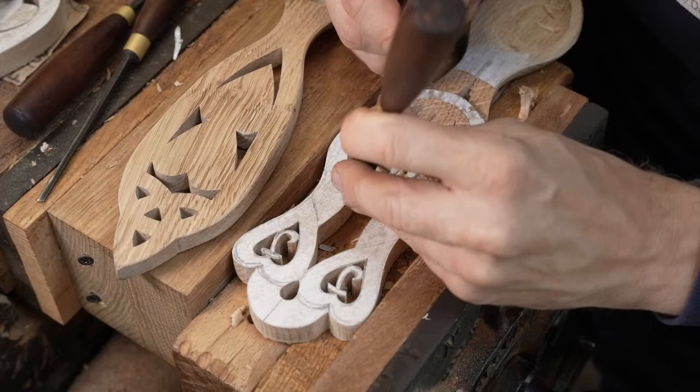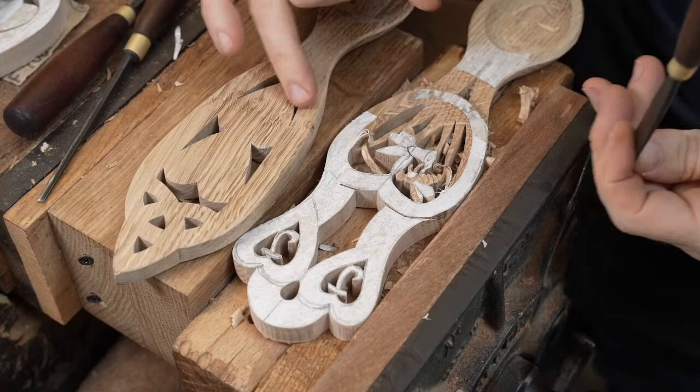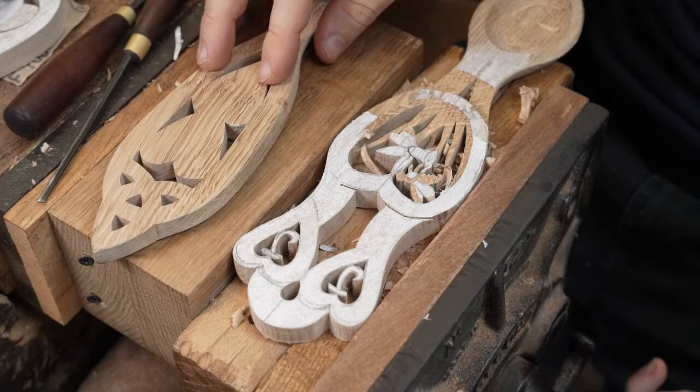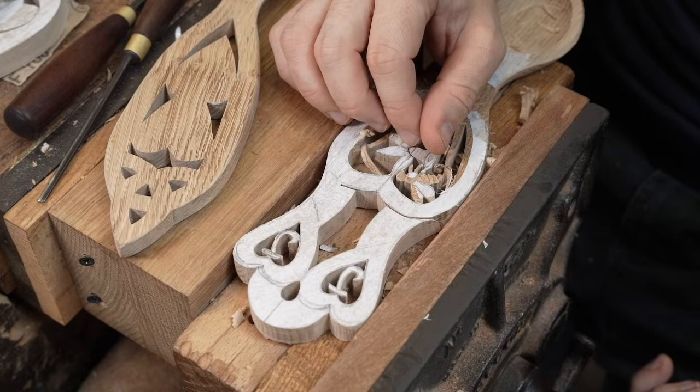It's basically the sort of decisions you're taking when it comes to things like tear out. Going back to it, in and around knots, those areas can be tricky to carve. So for instance, I will bevel that edge, but I'll be cautious when I'm beveling that. So that's the sort of thing that can cause tear out. The other thing then, if you've got a diagonal grain when you mark it, again, that could be a possible problem when it comes to carving.